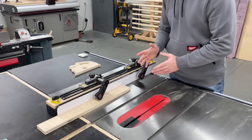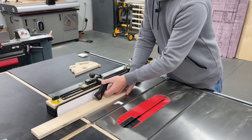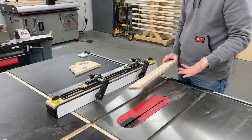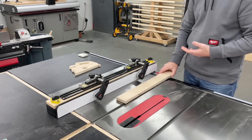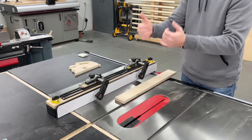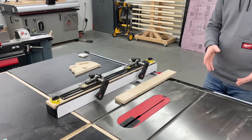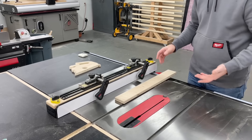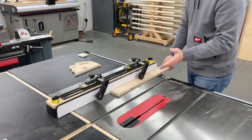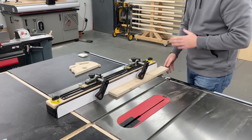The guides also have one-way bearings, meaning the wheels can only roll forwards, not backwards. That's a safety benefit because next to touching your hand on the saw blade, the next danger on a table saw would be kickback — where your material gets bound up between the blade and the fence and will either fly up and back at you or straight out the back. You should stand off to the side to avoid that, but that's not always possible. So with these, at least you have that added safety benefit: even if material gets bound up, it can't pull back and shoot out at you. It can only go forwards.